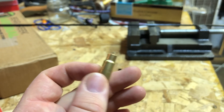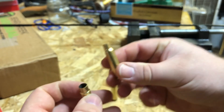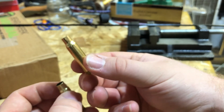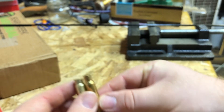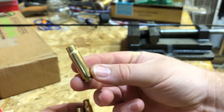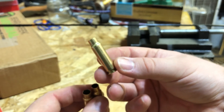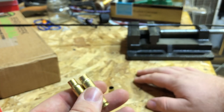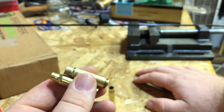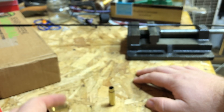This was near a max load on a case that hadn't been fire-formed yet. To be clear: I formed it, trimmed it into a TAC-30 case, and hadn't fired it before. The other case had already been fired once with a milder load — it had kind of fire-formed to the chamber — and its shoulder got bumped slightly. What I've learned is maybe take it a little easy on the first loading after transforming it into a TAC-30 case.